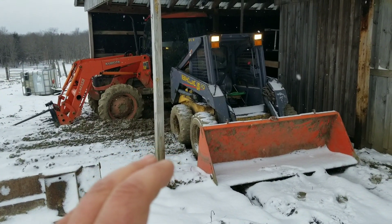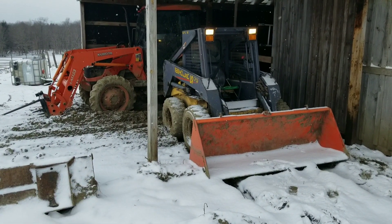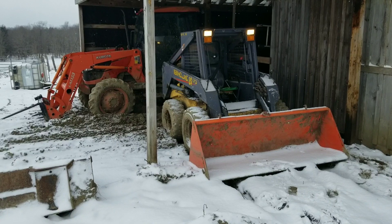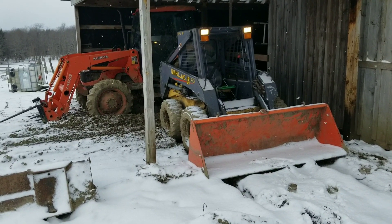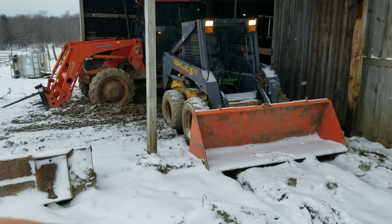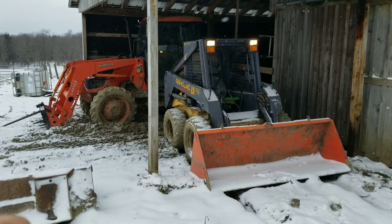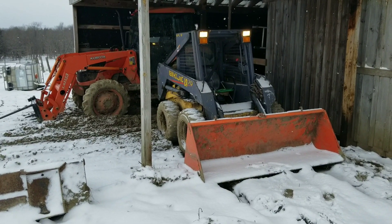Currently, the LS-170 New Holland has a really bad creep again. I haven't had a chance to get it into the shop to get a look at it and see if I can adjust the linkage or anything like that. So we're kind of just using it as it is — it has to get fired up. And with that creep being frozen in the ground, the hydraulics were trying to work a little bit harder than they actually should have. So once I get it to a decent idle, I throw the parking brake up on it and it won't creep anymore and will warm up properly.